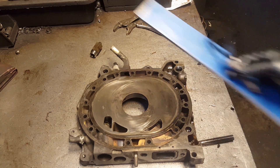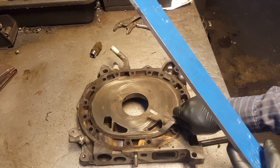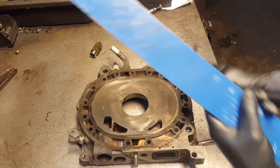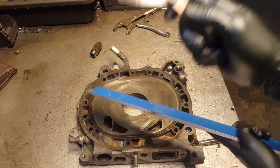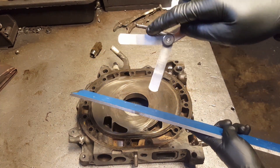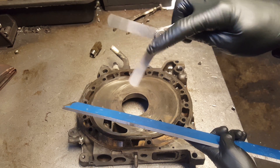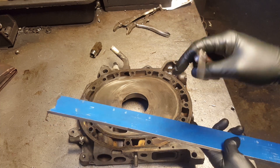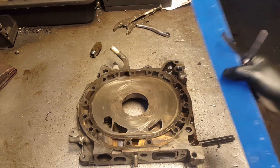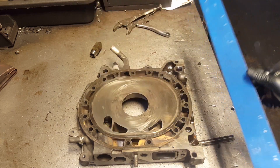What's going on YouTube! Today we're going to check if my iron plates are straight or if they're trash. We're going to need a straight edge and a feeler gauge. I'm already set up at 0.03 and 0.04 — those are the acceptable ones. We're going to check top, bottom, middle, and sideways. Let's start.